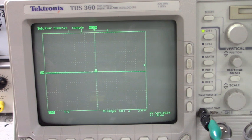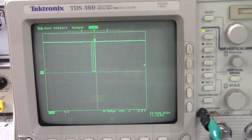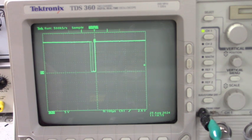Okay, now let me pull pin 9 of that stake connector up to 15 volts DC. Once again, there is pin 2, the anode side of the input LED. Let's go look at pin 3. This is the cathode side. Look at that. It's being pulled to ground. So that input LED would be conducting if the anode is at plus 15 and the cathode is at ground.